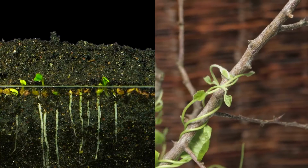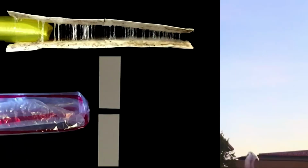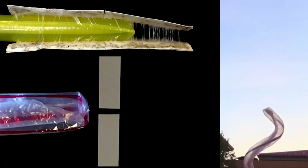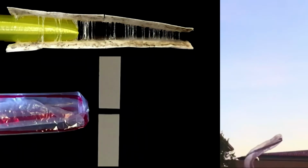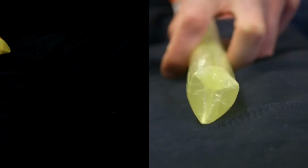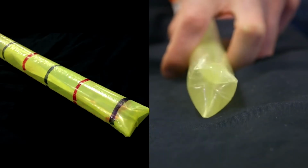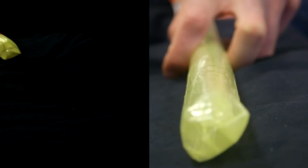Inspired by vines and plant roots, the Hawks lab here on campus has pioneered a new type of tip-extending soft robot. Powered by compressed air, these robots are able to grow and lengthen their tip without their outer surfaces moving at all. This solves a couple of the problems we had with placing an anchor earlier. Instead of sliding through the soil, the walls of the anchor stay in the same place, even as the anchor grows deeper, reducing the force you need at the surface to place it. With the right design and conditions, these soft robots can even self-anchor, taking no external force to grow arbitrarily deep.